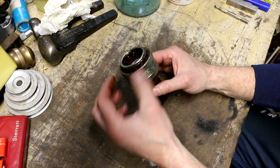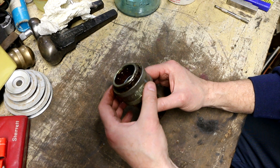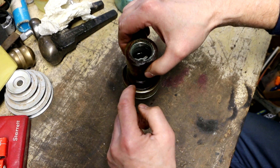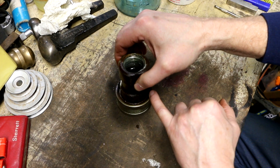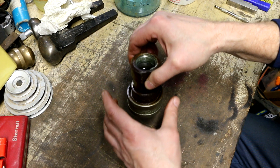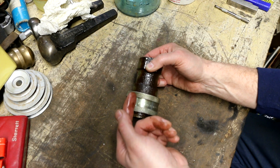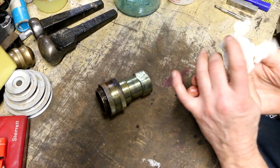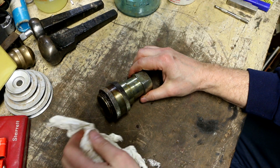I could not for the life of me get this ring to rotate or pull down so I could get it to release. What I ended up having to do was soak it liberally with PB Blaster — it was actually on the machine like this — and keep working at it. Put a pipe wrench on here, got this to start turning a little bit, and then eventually tapped with a punch along here to tap this ring up far enough so it would disengage.